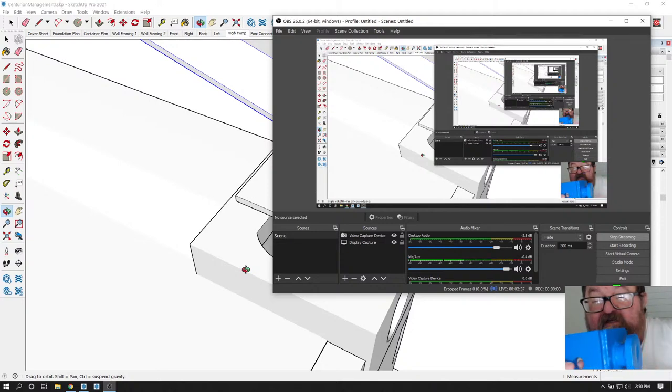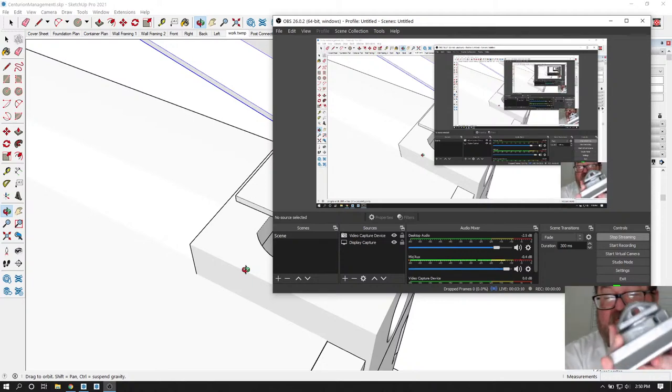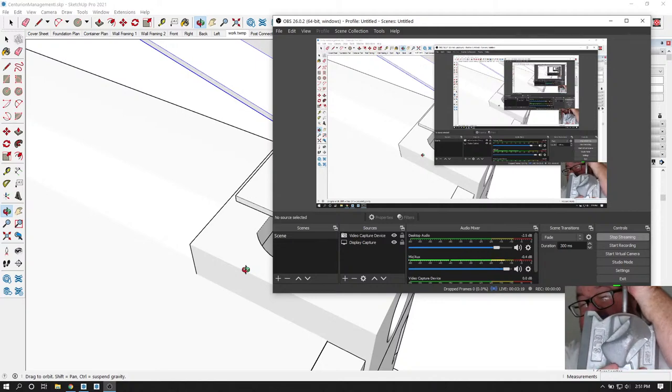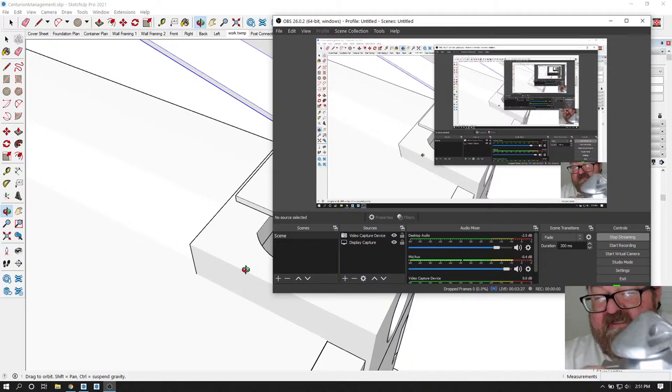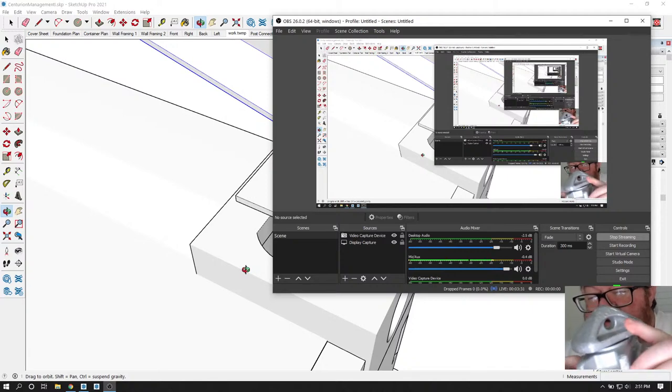This twist lock, you put this in the hole of the shipping container corner casting and you turn it and it locks into place. Then on all the drawings that I have ever done on shipping containers, I show a similar L bracket. It's not this heavy because I don't think it really needs to be. This is like 3/8 steel, maybe a quarter inch, but it's basically the same concept. It has a hole that you bolt down to the concrete. This is the one I bought, the twist lock that you stick in the container casting block and turn, and it locks into place. The magic of both of these is the shape of this piece right here, the length and the width of it and how it locks in.